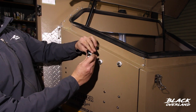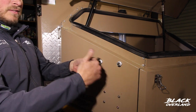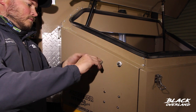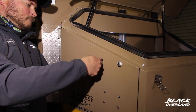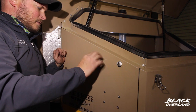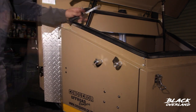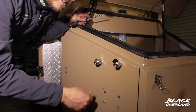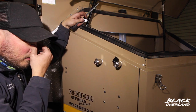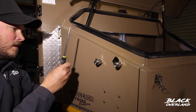These stopcocks have a little plastic handle and I'm trying to get them to angle that way so that if any stones and stuff fly up, they hit the stainless steel, not the plastic handle. I'll put some more plumber's tape in there so that it gets tighter at a different angle. Now that I've lined them up, I actually turned the stopcock and realized that is the closed position, which still makes them vulnerable to stones coming off the car. So I've just unscrewed the handle and I'll put it on in reverse.